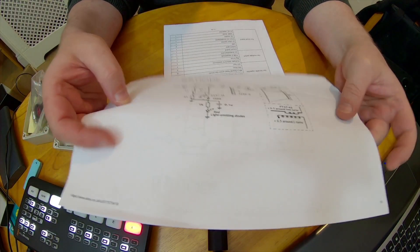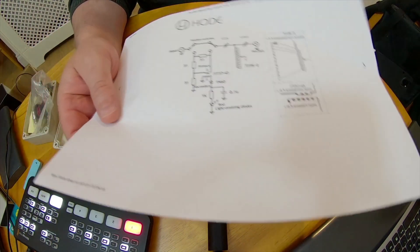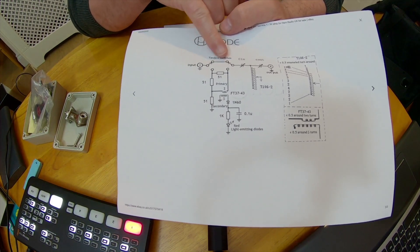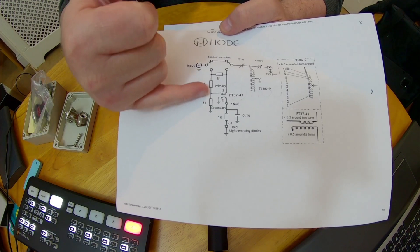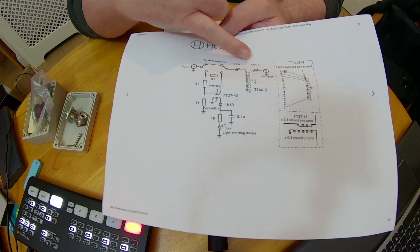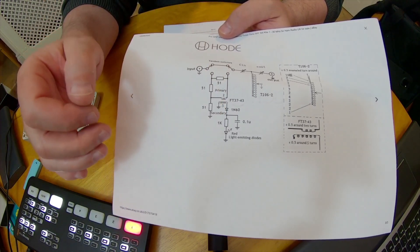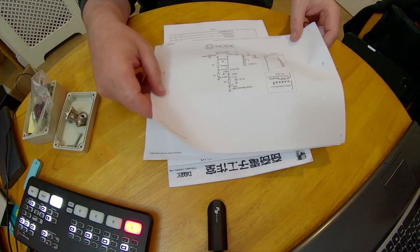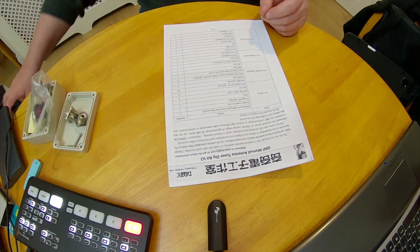All I need is a little tin to put it in — this handful of bits plus everything else I've got upstairs. Let me show you a typical circuit. There's the SWR bridge with the LED at the bottom. You use one switch to flick the bridge in or out, then tune your two capacitors to get the best SWR by dimming the LED. It's a fairly basic circuit but good fun.